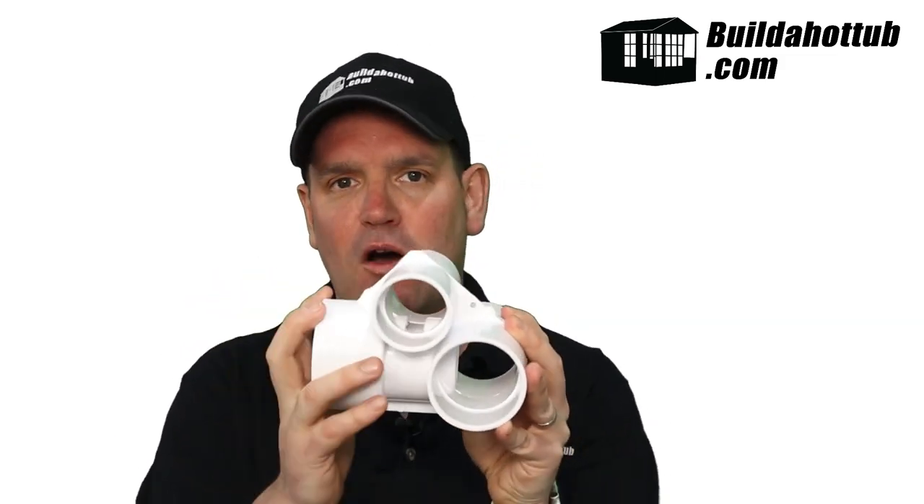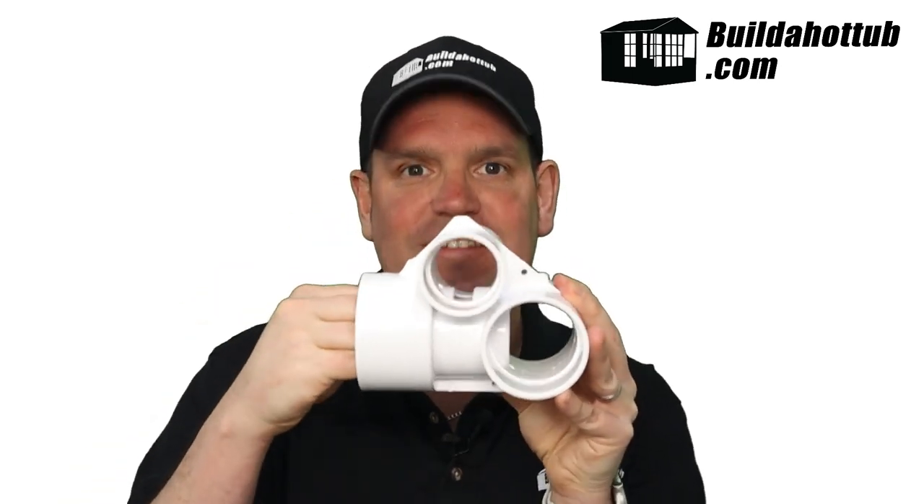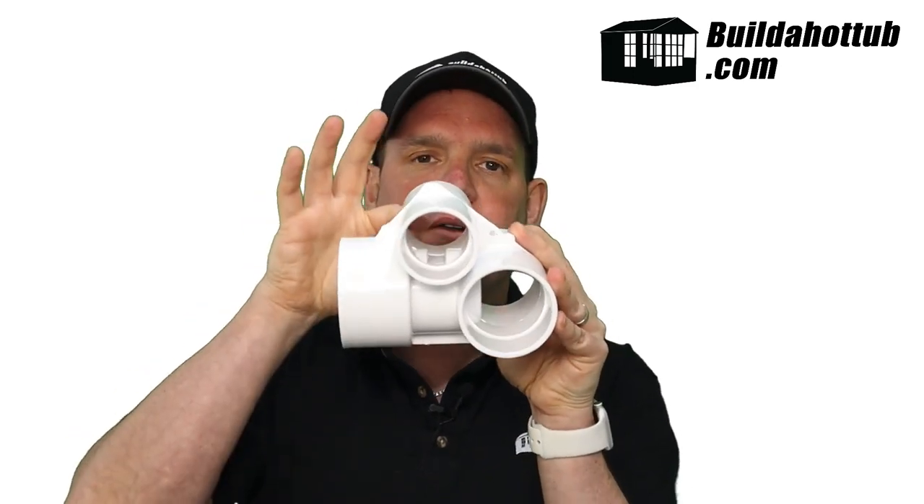This is one of my favorite gunite bodies — I talk about these a lot on this channel and on my blog. Just a quick recap: this is a two-inch water line and this is a one-and-a-half-inch air line. The blower will actually blow air into these lines. What happens is that the water and the air mix inside of the gunite body. And if you can just about see on the camera, there's actually a hole in the airline. So when the water passes over that hole, it draws the air in — and the process of drawing the air in is called Venturi. So even with an air blower on your system, you're still utilizing the principle of Venturi to get a stronger, more bubbly jet.